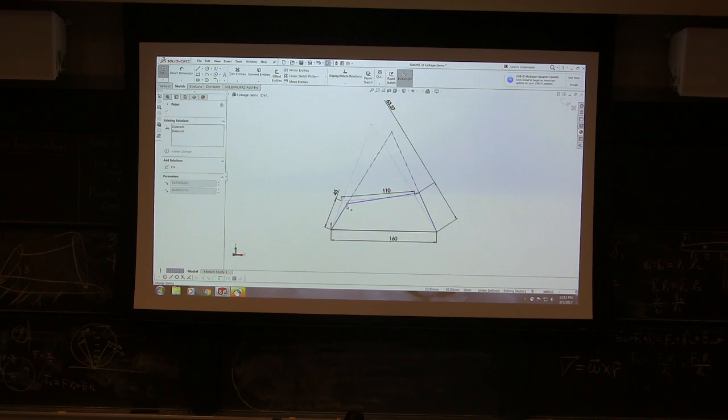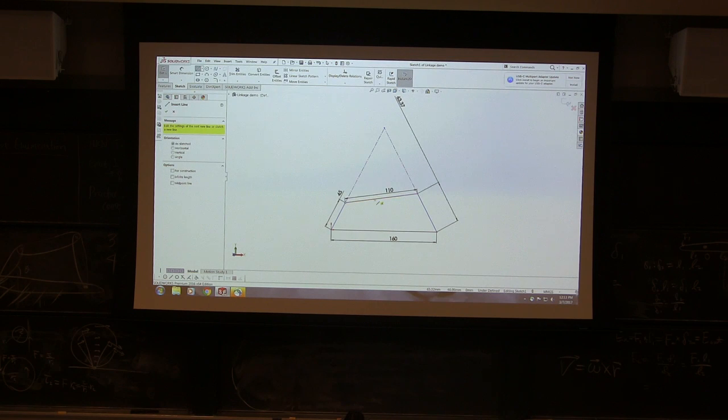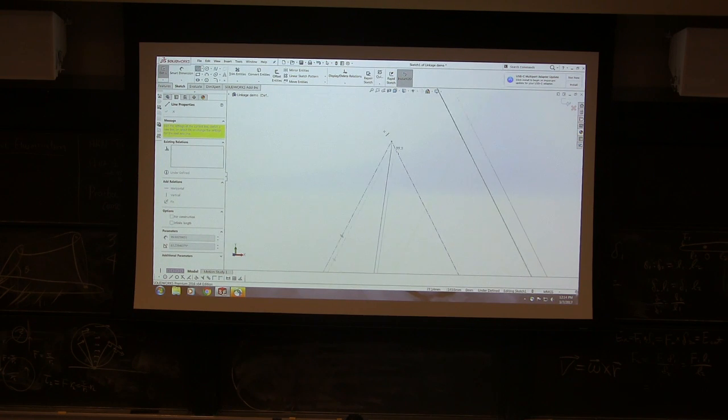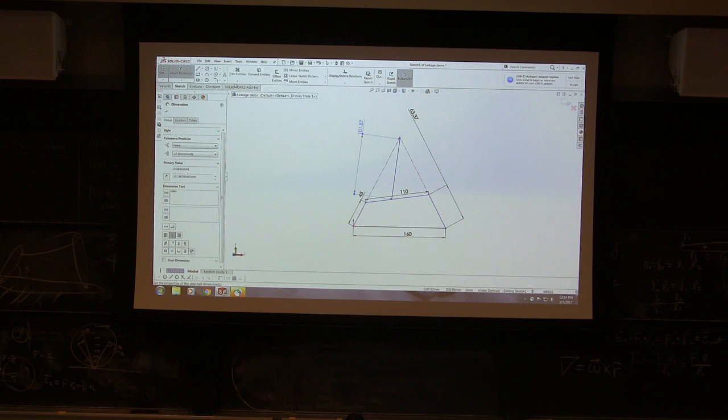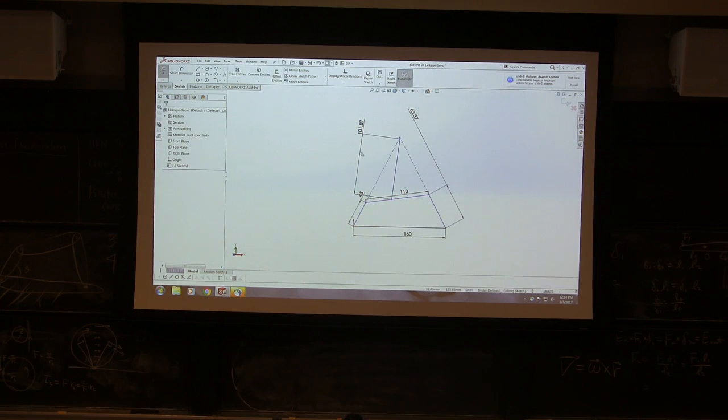Now you can see this guy. You see that? It creates some sort of weird trajectory. So I want to prove to you that's actually the real center of rotation in this configuration. If I draw a line very close to this circle, not quite meeting, I want to just point it out. And I'm going to make this guy rigidly attached to that link by making the length fixed and the angle fixed. That's too complex. I'm going to just make it a block. Click this and click this, shift, and you can make it a block. Block. Okay, you need to always click OK.